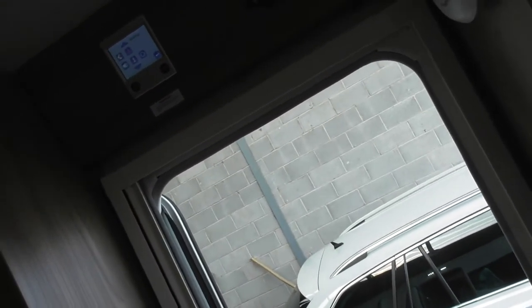It'll just stay on. You may find that beneficial if it's really cold and you want it just on continuous. The only thing is, the water is going to suffer because obviously it's taking the heat away from the boiler continuously. It's not going to get the water temperature you may want.